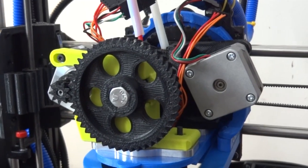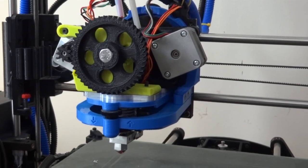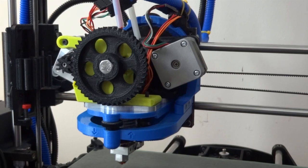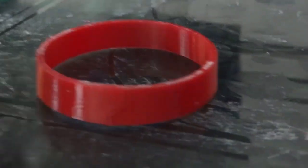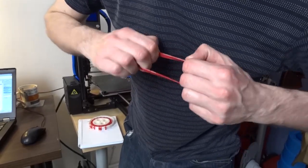We've got two extruders so we can print in two materials. What it means is we can print hybrid parts made in one print and fused together with heat — we can actually build an ABS and NinjaFlex part which are effectively welded together and made in one piece. I've got a NinjaFlex part here which is just a very flexible band — that thing is incredibly strong. LulzBot have a video on their channel of someone hanging on a piece of NinjaFlex and it doesn't break under the weight of a person.